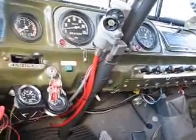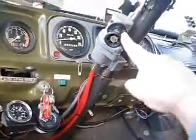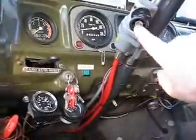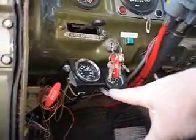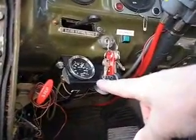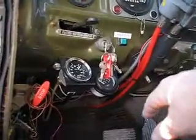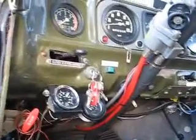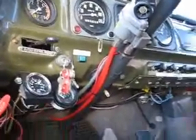So the driver's cab is more or less the same. There's the deadman switch, which I now use as a handbrake. And we've got the extra air gauge for the secondary braking system. Without air pressure on this system, the brakes won't come off. The old caliper-type traction handbrake was completely removed during the engine swap.